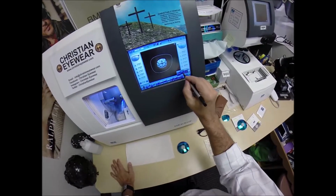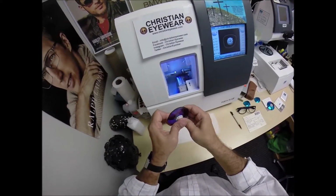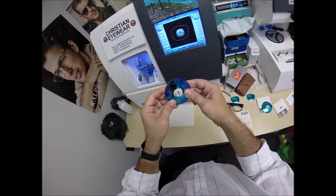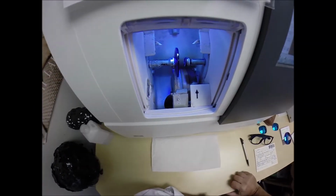So I am going to put a safety bevel on the rear concave surface of the lens. So now the magnet's going to do its job a second time. I'm pressing the sticker on there firmly. It's going to attach itself to another magnet there in the chuck,